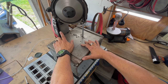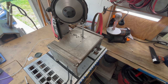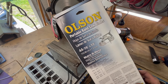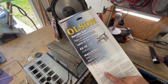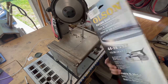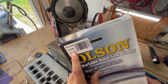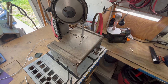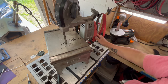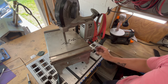The Bauer bandsaw I have is a five-speed bandsaw. It uses 44 and 7/8 by 1/2 inch bandsaw blades. I try to use a coarse tooth blade meant for quarter-inch thick steel — specifically 14 TPI blades. On this side of the bandsaw there's a knob that allows you to pick all the different speeds that you need.